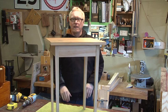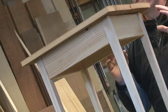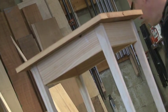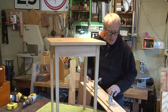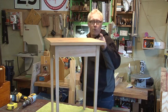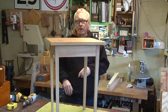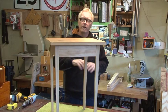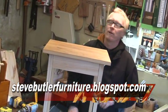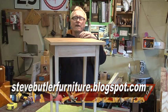As usual, I had a lot of fun making this project. There are many ways and techniques to make objects — we covered basic mortise and tenon joinery, we learned how to taper legs, and we made our taper leg jig. If you're going to taper your legs the whole length, remember to do your mortises first while they're square. A simple little project that's been done a thousand times — the difference is no joiner, no planer, no problem. If you have any questions or comments, please get in touch at stevebutlerfurniture.blogspot.com. I hope you come back and see what we're making next time here at The Garage.